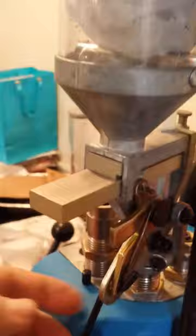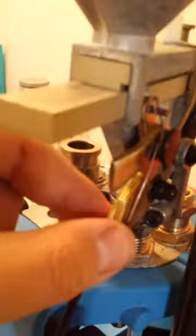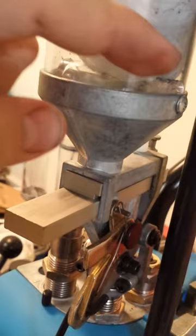As it gets pushed up, you can see that the linkage wants to move. When that linkage moves, the powder in the hopper — the powder bar moves forward and lets the powder drop into the funnel at the bottom, filling your cartridge case. Then when it's done, this bar here is what pulls the linkage back into position and pulls the charge bar back into place so it fills from the hopper into the charge bar.